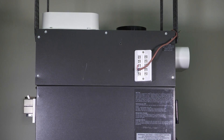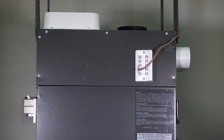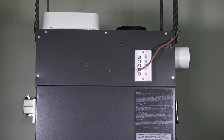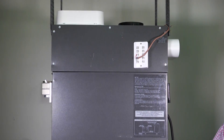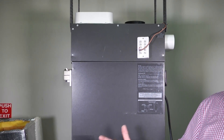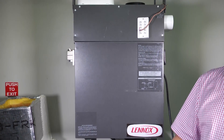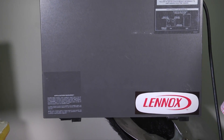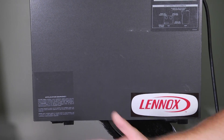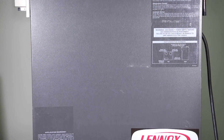Bathrooms, kitchens, laundry rooms — anywhere where we're going to have lots of moisture being built up, we want point-of-source removal of that air. That's not to say I can't put an HRV onto a system where I don't have those point-of-source places already installed. I can take an HRV and put it onto an existing ductwork system — I'm just going to take air out of the return air, send it outside, and put air back into the return air in order to exchange that air.